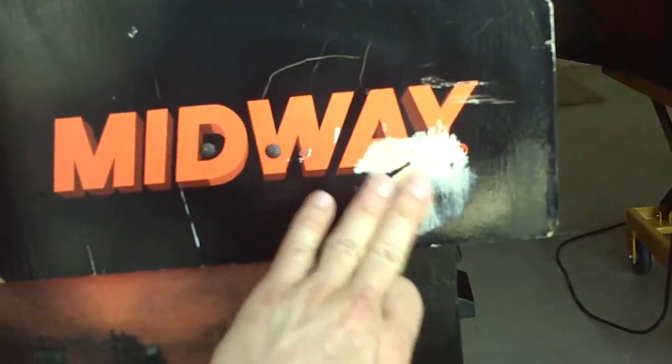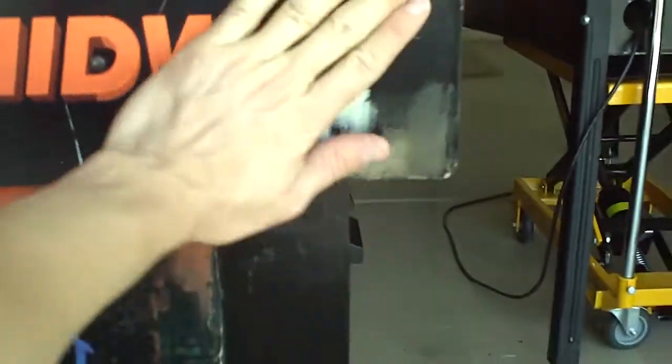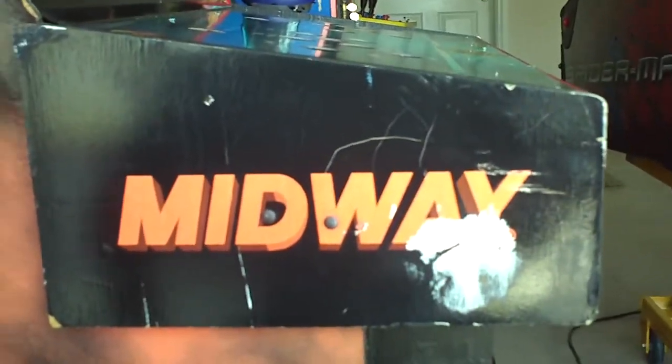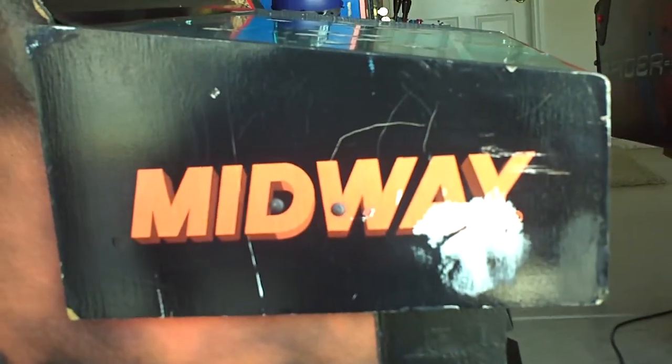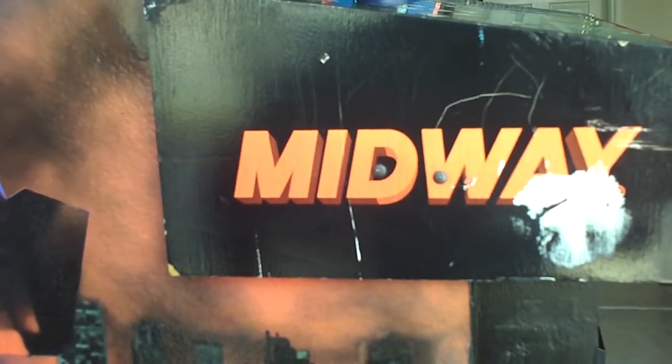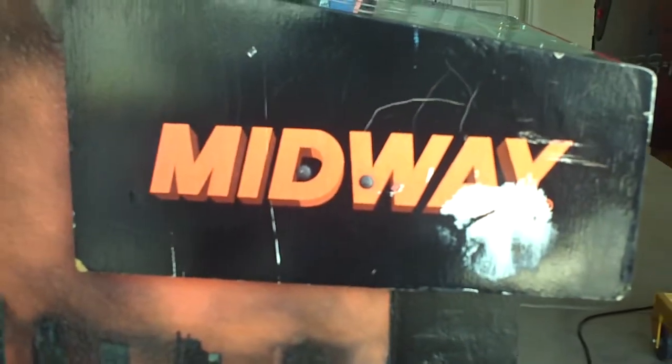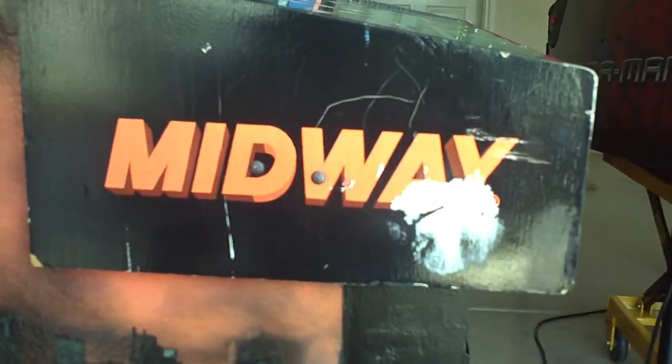Like I said, the control panel, I got the full-size Midway decal, so I filled in any gouges with some wood putty, sanded it down, so I got a nice smooth surface to apply the decal. What I'm going to do this time is follow MK Arcade Source's advice on this, which is not just peel them off and stick them, but I bought some 3M super adhesive spray. So I'm going to spray it on this surface or on the back of the decal, depending on which one works best, and then apply it. That way it'll never come off.